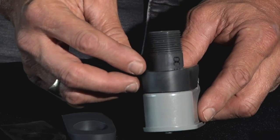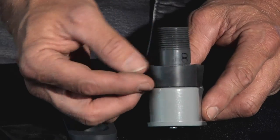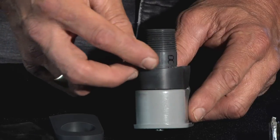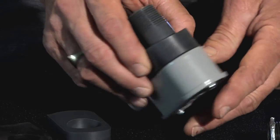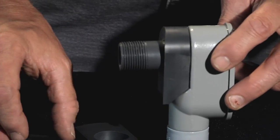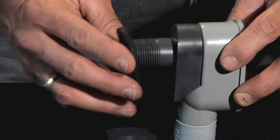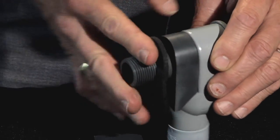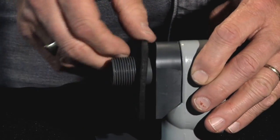And if you look at that, you can see that that's not a flat piece of plastic. It is machined with a contour which matches the contour of the outside of your casing. So when you slide this in the hole, this will come up nice and snug against the outside of the well casing. You'll have your rubber gasket — the rubber gasket is the watertight seal — so no silicone is required.